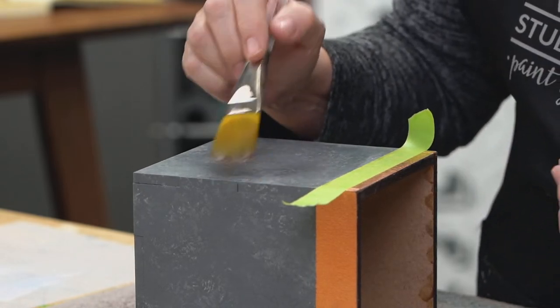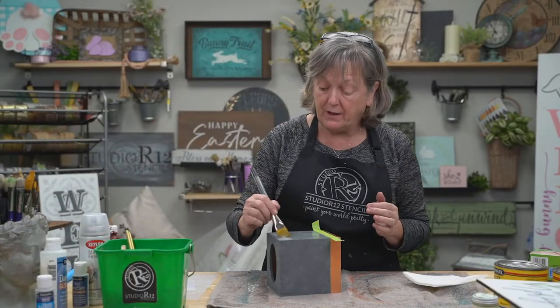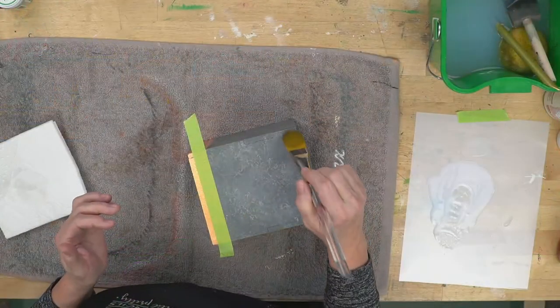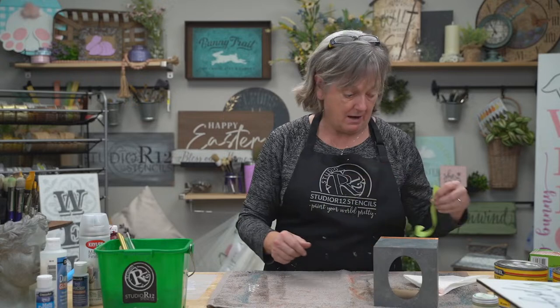It's not going to pull for me. I'm sorry, I don't know if we could see it if it did. But you'll know it when you get a little pull. It's a sticky, streaky mess. I'm going back through this right now and it's not doing it. But anyway, it makes little drag marks in your varnish, and that is not okay, so you don't want those. And I think I've shown all the things.